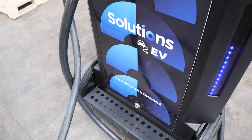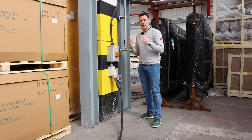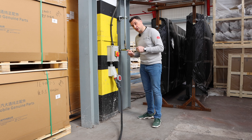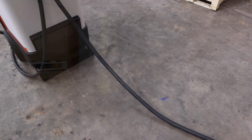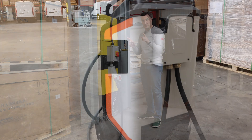You need to be in a commercial building that has three-phase power. In the UK and Ireland it's usually a commercial building; on the continent, the majority of wiring is all three-phase. You need a minimum of a 32-amp outlet — this one we have here is a 63-amp outlet. You can see the socket here, and the cable that joins this from the wall to the T-Series itself is five metres. Running off a 32-amp will output 20 kilowatts, or running off a 63-amp will output 40 kilowatts, either singularly or split.